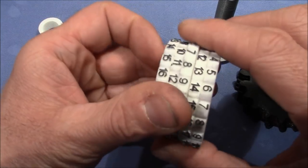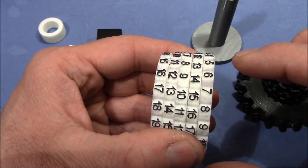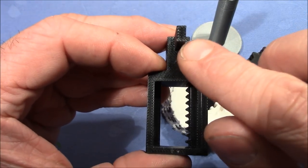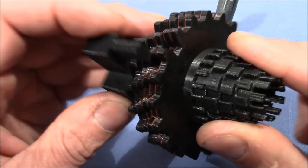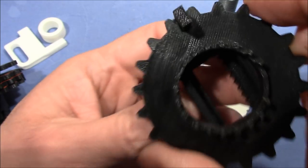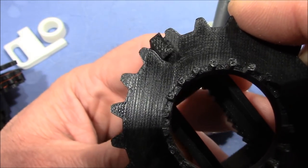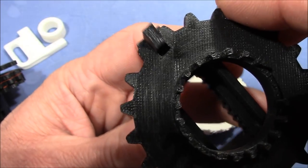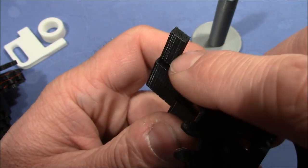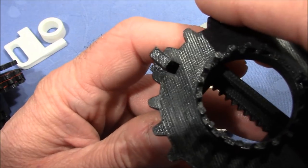What has already been done with the next prototype is to have the outer wheels in different diameters — smaller diameters towards the end — which allows easier operation. Next would be the actuator shape. We can see there are sharp edges here, and the bar of the actuator goes inside and rubs against the surface, causing wear. The sharper these edges are, the more wear you have on the inner parts of the gates. I would suggest making this round — cutting away a little bit from this edge so that it's rounded — reducing wear on the inside of these gates.